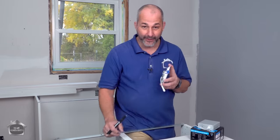That box installs up in a nice spot. Fish your wire up and rest the first pin, slide it up, put the second pin up, and guide it into place. If the light is sitting a little off the drywall because of the gasket, remove the gasket everywhere except bathrooms — that will make sure the light fits nice and snug. A good solid spring snaps it right into place. With cheap lights they just sit a little loose and you're tapping and spinning them trying to find the happy spot. With a good one, there's no gap showing no matter where you put the light.